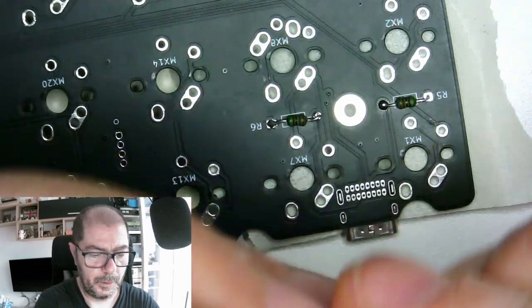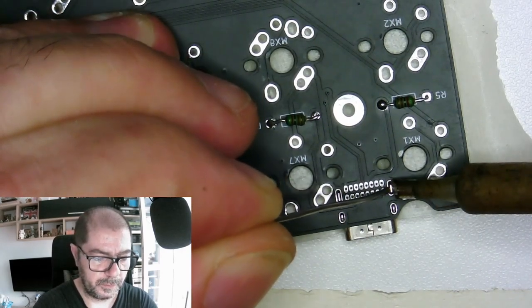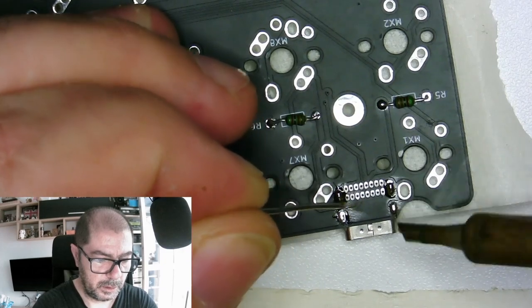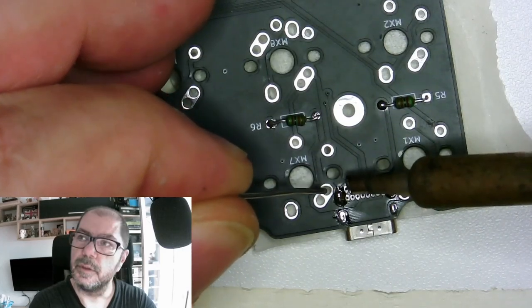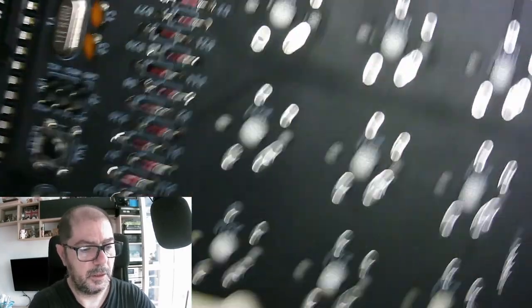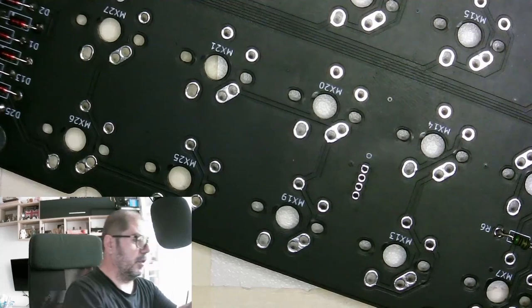Now you see it. Okay, this is the most difficult part for the majority of the people. I will start with fixing it, because it's too hard. I wish for it to be fixed, and that will help me to have it stable. And then I don't care about the other stuff. I have a big tip. The tip is too big for this. So if we trust the solder mask, then it should be nice. All we have to do is to add a little bit of flux and then solder it.